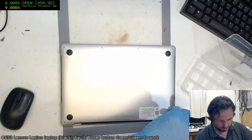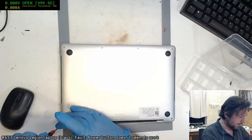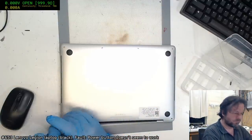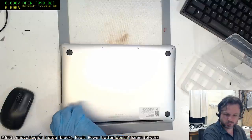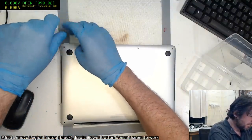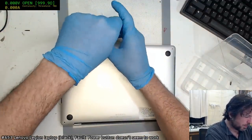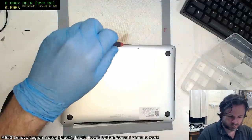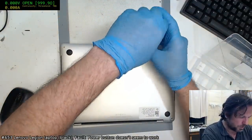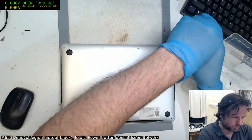There, Barry, no soldering required. I was tempted to, you know, I could have put a replacement tactile dome switch assembly there. Certainly I have them, but since I found the dome and the Kapton tape, I figured no point. I'll just put some new tape on, stick it down, and then give it a little bit of reinforcement with that hot glue.